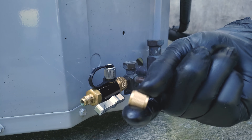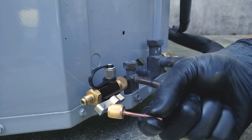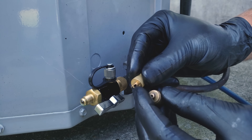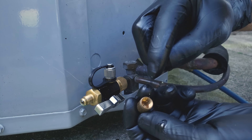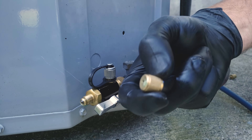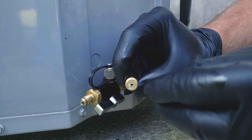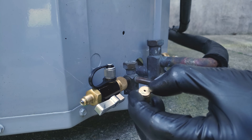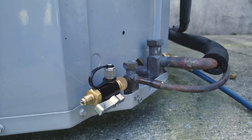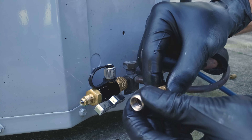The other tool is literally just a cap — very simple. I tried a couple different versions: one with a tube soldered in the end, and one where I broke off the tabs and drilled a hole in the end — you can see that right there — and I took out the rubber washer. Through all my testing, this is the cheapest, simplest, fastest, and actually gives the best results, because you have a large flat surface area for a large bubble to be blown. You can make one yourself — maybe paint it a different color so you don't accidentally leave it on a port when you're done. And obviously for outdoor locations, we're putting locking caps on using a tool.